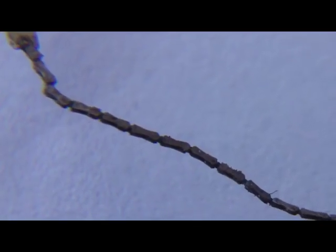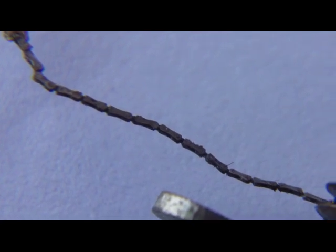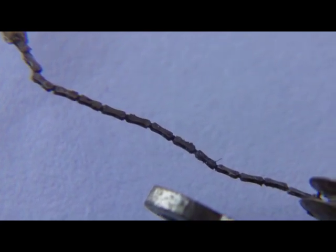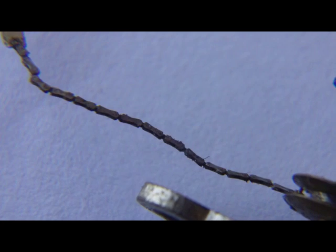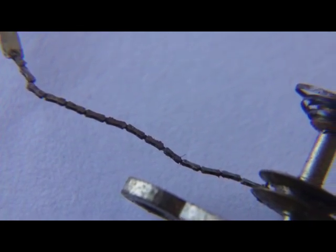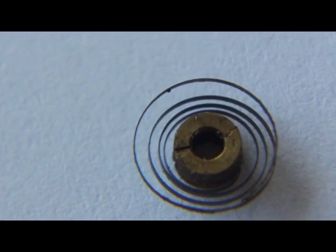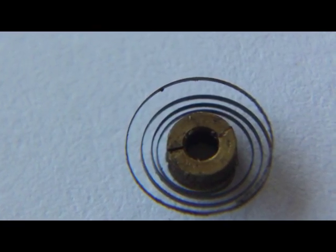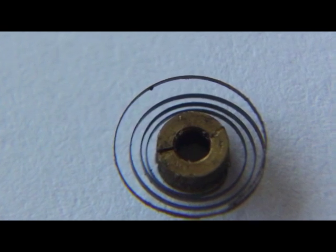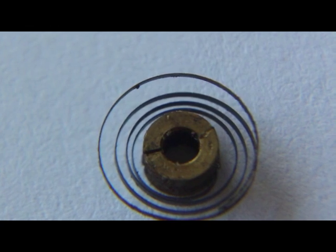The aneroid mechanism connects to the dial spindle with a very fine chain, like a fusee chain, and that seemed to be free from damage so I guess it had been oiled. I took the pointer spindle and the damaged spring out of the mechanism and pressed the collet holding the spring off the spindle.